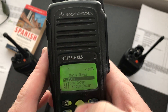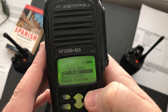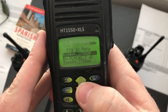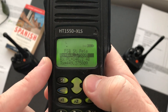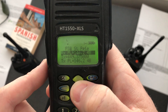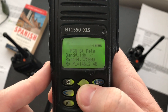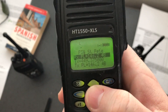I'll show you. You go in here — I have everything turned on — Edit Mode. Edit. Password is 1234. And there you go. You've got to have edit mode enabled in the CPS for the particular personality you're on. You can set up your PLs, go to wide band or narrow band, or 12.5, 25, and 20 kilohertz. Of course, it's ham, so we're all wide band still.